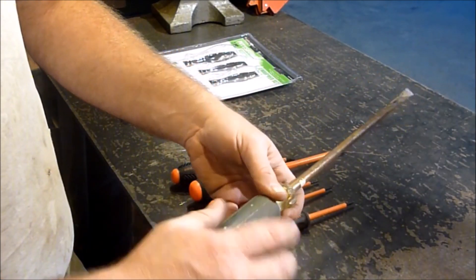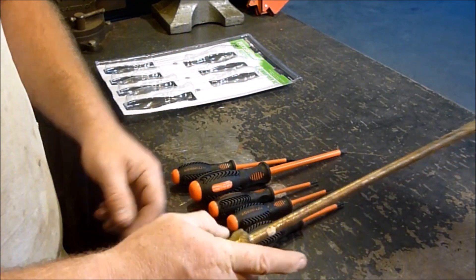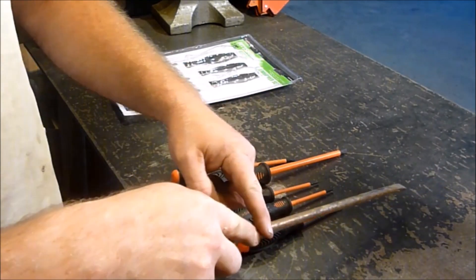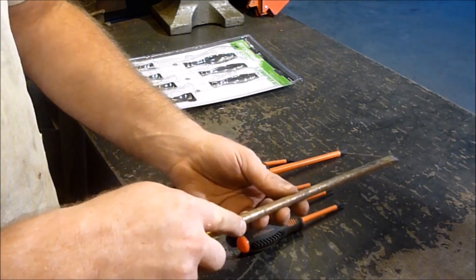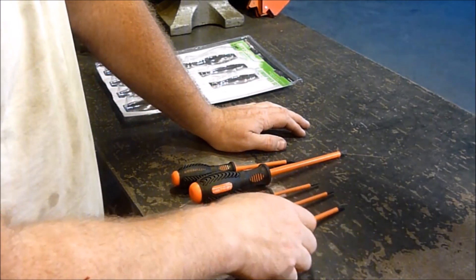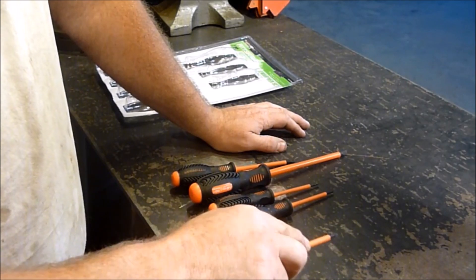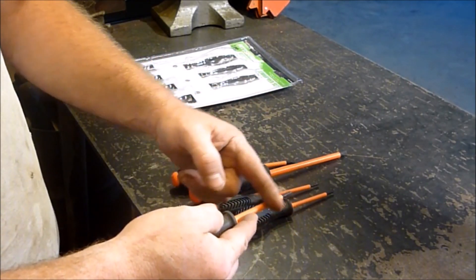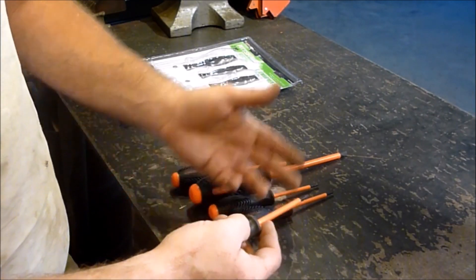But let's say it was just an end like this — then I'd probably be okay. A lot of people take screwdrivers and tend to rest their finger on there and go like this. Then you're grounding or connecting yourself to this metal screwdriver. You touch electricity, it's definitely going to nail you. With this, you still have chances, you still got to be careful. But if your finger's on there and you're screwing and you touch this to electricity, there is a cover here that keeps the electricity from coming through and into your body.